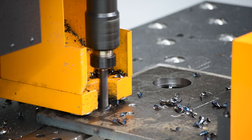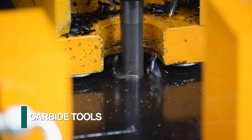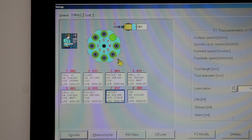This positive feed direct drive system with reserve power and spindle speed enables the use of carbide tools for extremely productive drilling performance. An 8-position automatic tool changer provides for a complete complement of operations.